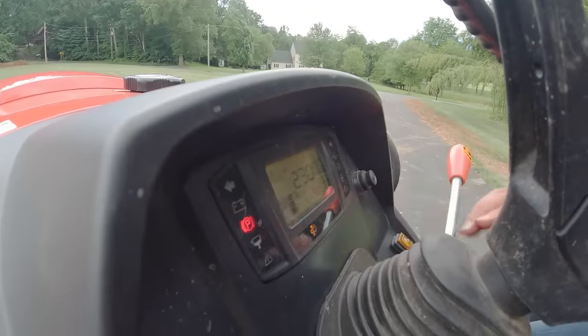My light's now solid. I only stepped away from the tractor for about two minutes, but it heated right back up again and now it's off and going. The burn cycle has started. Now would be the time that you would ideally not turn your tractor off — you'd like this cycle to finish. If you have to, you're not going to ruin anything; the next time you start your machine, it's going to want to start back up again. The thing you don't want to do now is slow your revs down. You need to continue to have that heat, so the RPMs need to stay up so your engine continues running hot. Internally, your engine is letting a little bit of fuel go by on the exhaust stroke in order to run that burn cycle inside the Easy Bake Oven. When this is burning, you can actually smell it a little bit — it does create a little bit of exhaust odor. It's not obtrusive or disgusting or anything, but you can definitely tell that it's happening.